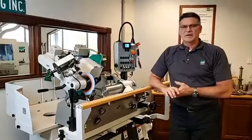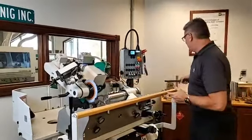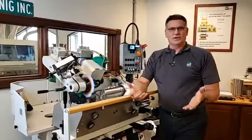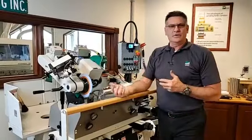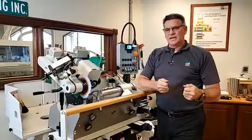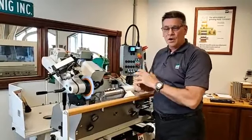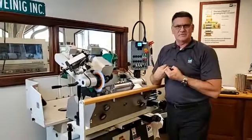Okay, the question is about our Weinig grinding service. We do have a water jet for doing pre-hogging on knife steel. That is a huge benefit to a customer or a company who has one grinderman. They have multiple machines out there, and maybe he runs a rip saw as well. He's a very, very busy fella back there. So if we can keep him from just standing in front of the machine and making a bunch of sparks to remove or hog away all the excess steel for a particular profile, then that's buying him some time back.